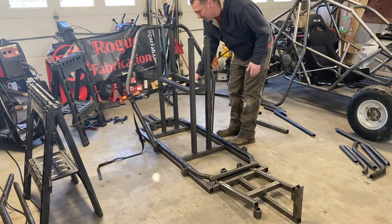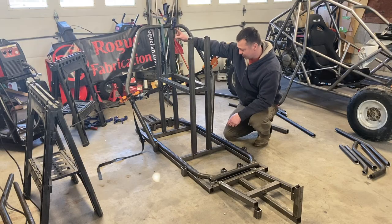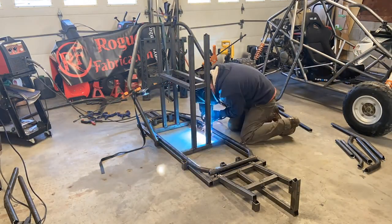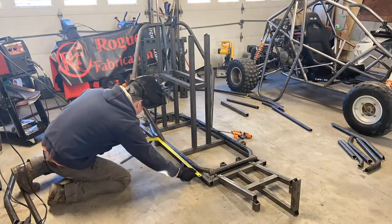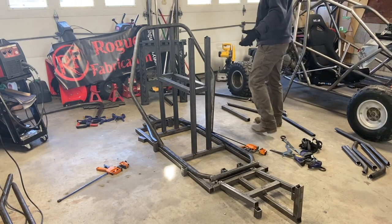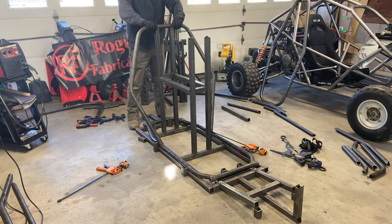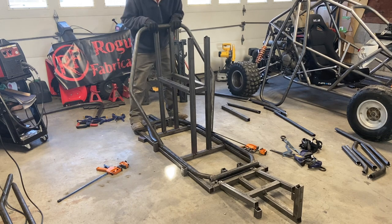I've got the hoop in place with the strap on but haven't tightened anything yet. It's very close to center and this side is lined up. Since it's sitting flush in the jig and flush with the rail, I'm going to take a measurement, match up the other side, crank it together, and tack everything up. The connection points to the side rails are equidistant from the front tube. The top is centered — it all came together with some cargo straps and dedication, and a tube that wasn't bent perfectly is now completely square on the assembly.